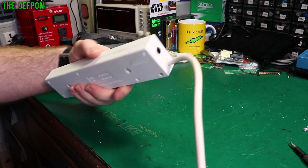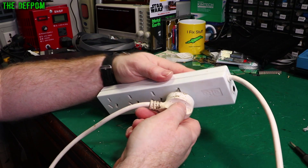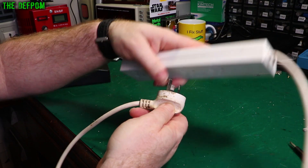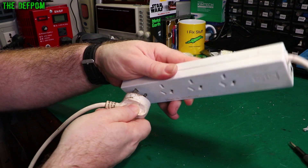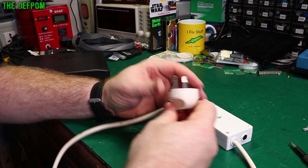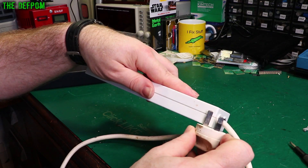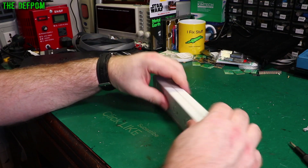I tidied up all those connections and made them all a bit tighter, unbent everything and put it all back where it should probably be. And this is feeling better. But I think part of the problem with these connections is that the actual pins only barely contact inside as well — then they just go in because of the depth of those connections. It's going a lot better now, much tighter than before, but I think it's only literally going in by a couple of millimeters into those actual connections. It doesn't really engage until it gets down that far — it is too deep. If you plug it slightly out, it's going to cause problems.